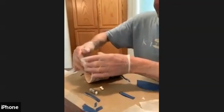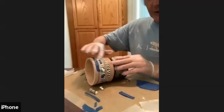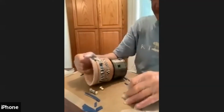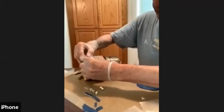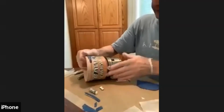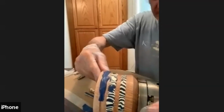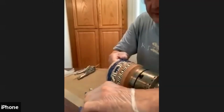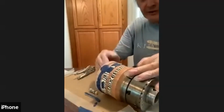I think the real critical part is that the Milliput isn't below the surface of the wood. It's got to sort of be bulging out. Not a whole lot, but enough that you're sure that it's way above the surface. Like over here, you can see that it's sort of hollow down the middle. So I would either push it in from the sides, like that, or I would take some leftover pieces like I have here and just put it on top there to make sure that it's bulged out.